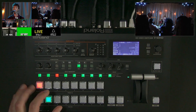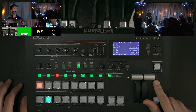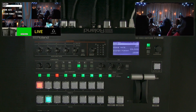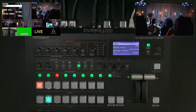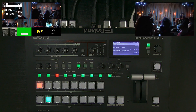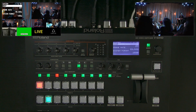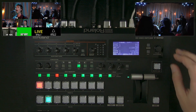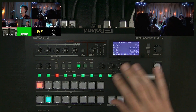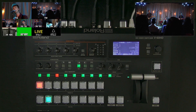We've covered the basics of switching. There's also an HDCP indicator in the system menu — if you need to bring in a Blu-ray player with HDCP copy protection, you can turn this on. It'll do a soft reset and disable the SDI outputs as part of HDCP compliance, but you can get the signal through. Above that is the output fade, so you can do a fade to black in addition to the mix controls.